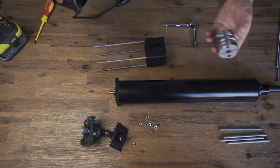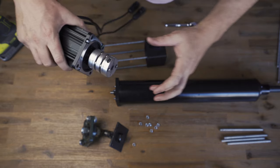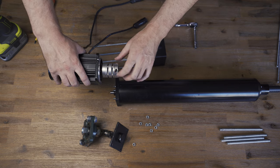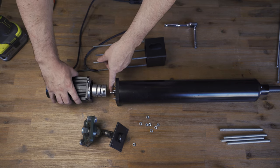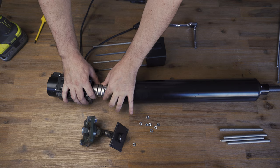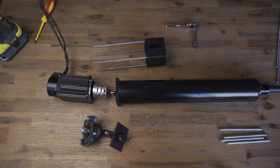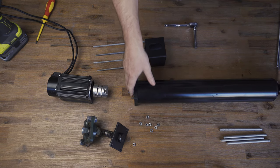In this sense you want to put your motor coupler onto your motor — keep it all loose. Once you've put it onto your top hat, keep it loose until you've bolted the whole lot up, then it aligns itself, and then look at securing the coupler. Otherwise, if you secure the coupler now and it's a little off, you're going to have a hard time getting it on the end here. Also, if you do get it on, the coupler could be flexed, which is going to put a lot of strain on it — especially when it's doing 3000 RPM backwards and forwards all day long. It won't last long at all.